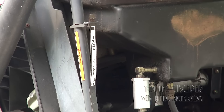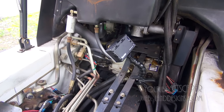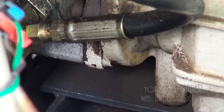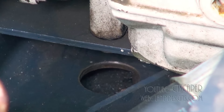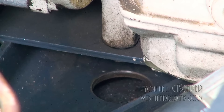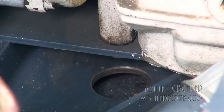Make sure that this piece here clicks in and locks the cab up. This one's going to be a little bit tricky to show you, but this is the reason I got the XL wrenches. We're in the Bobcat, underneath the cab, and there is a bolt right there. I got the wrench under there and I put some torque on it but I couldn't get quite as much as I wanted. That is a three-quarter inch bolt going under and up through, and I'm not going to take it off because it was a bear to get on. All you're going to see is me stretching under there, but if I can get this XL wrench in there and give that another half a turn or so, it's not going to come off again down the road.